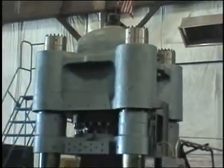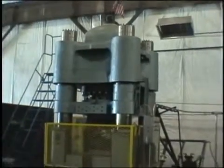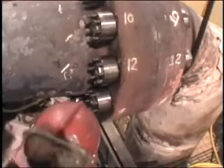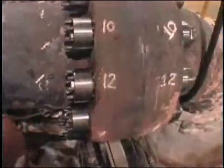You should skip this step, however, if you are stretching a long bolt or tie rod, and also when closing a large gap between flanges to avoid running out of jack bolt stroke.